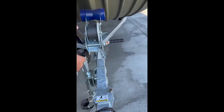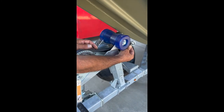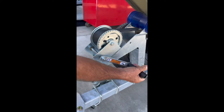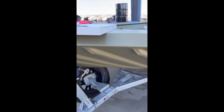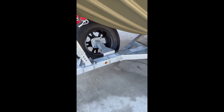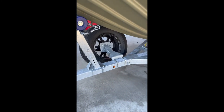It does have the standard wedge — a little bit of pressure downward will release it. You also have a safety cable while you're towing. To bring it back taut, you just pull this up and bring it back down tight. You have LED clearance lights — all the lights on the trailer are LED. Therefore, you don't have to worry about disconnecting the power when you go launch the boat, because the LED lights are cool and don't blow out. You can leave the trailer plugged in to your tow vehicle.